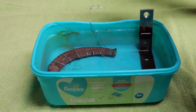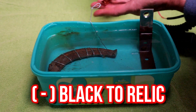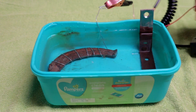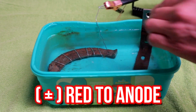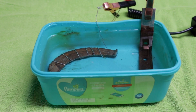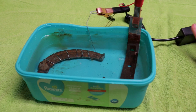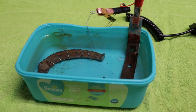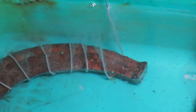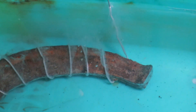Next up is the power source. The black or negative side goes to the relic — this is very important. And then the red or positive side goes to your sacrificial metal. Remember to ensure that your connections are secure before turning it on. Time to plug it in. If you see bubbles begin to rise, then congratulations, you have done everything successfully, and electrolysis is beginning on your relic.